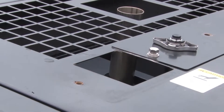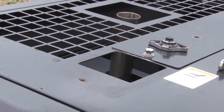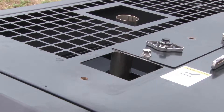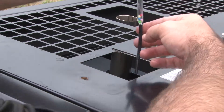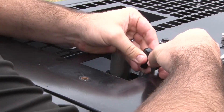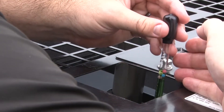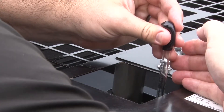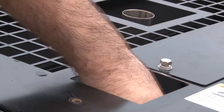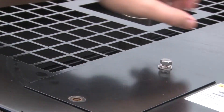During regular inspections, a hydrometer test can be done to the coolant to assure that it has not broken down chemically. To perform the test, remove the radiator cap after feeling to be sure that the engine is not hot. Stick the hydrometer tube into the radiator and squeeze the bulb to draw in the coolant. Read the scale on the side of the hydrometer to ascertain if the coolant is within the acceptable range for operation. If okay, replace the radiator cap and continue with your day's work. If the hydrometer reading is outside of the acceptable range, replace coolant as described earlier.